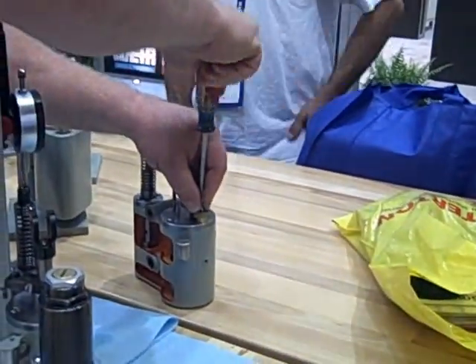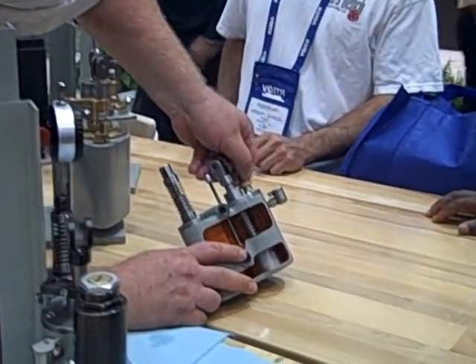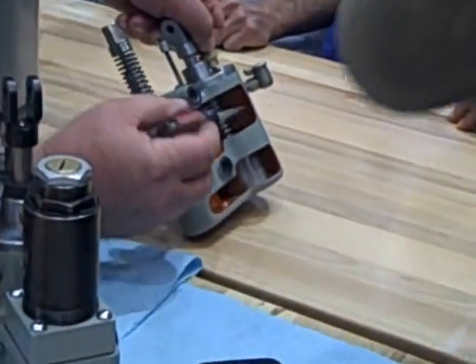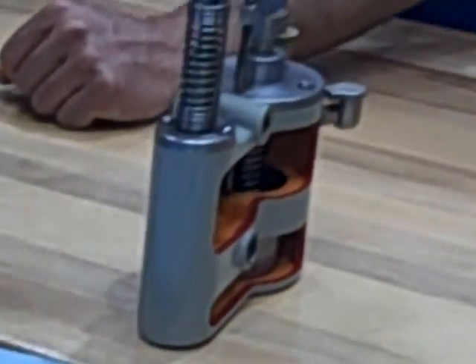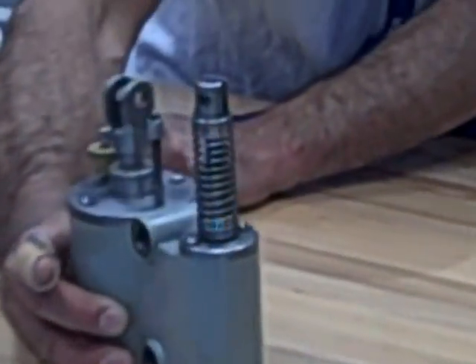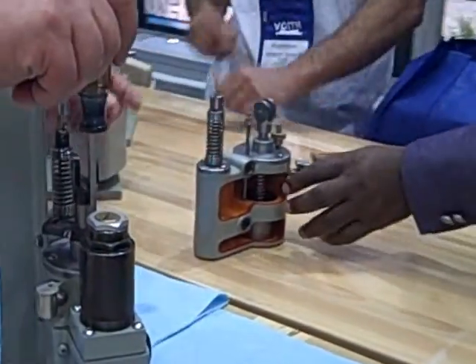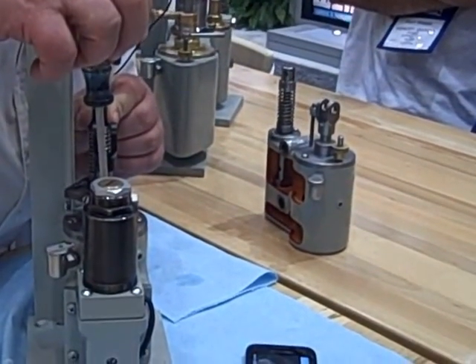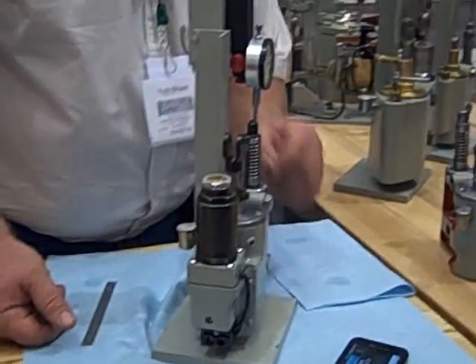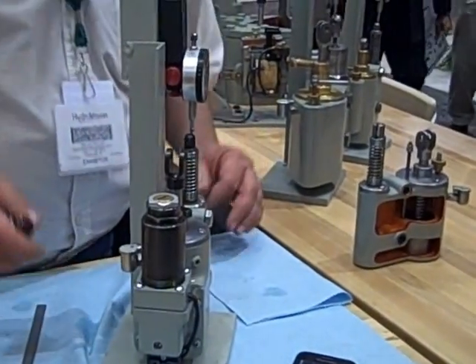I'll take this needle right out. See, that hole is right there — it goes through to the bottom chamber. You're looking at the tapered part of the needle. So when I deflect this plunger here, with the spring and the needle closed, I've got some spring force that's creating pressure in the bottom of the case.